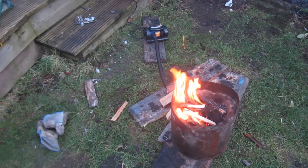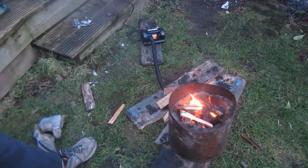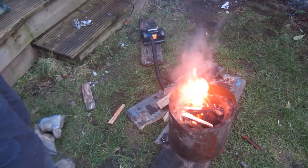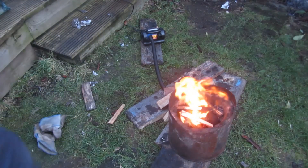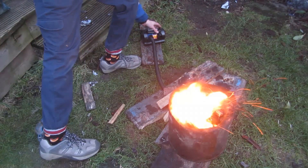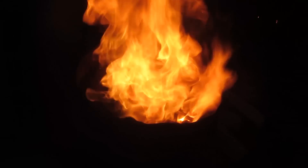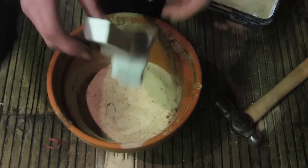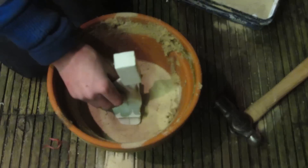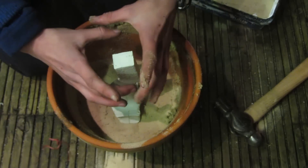Now it's time to cast the slingshot and the first thing I've got to do is turn on my forge. This is just a simple coal or charcoal powered forge. If you want to know how to make one, there's a great tutorial by Grant Thompson the King of Random on his channel — I'll put a link in the description. This forge works by putting the fuel — either coal, charcoal, or smokeless fuel — inside and then turning on the blower which supplies lots of oxygen to the fire and makes it get really hot. While the forge is heating up it's time to prepare the mould — I'm going to bury the foam inside some sand. You want to make sure the sand is quite dry and fine; the finer and drier the sand, the more accurate your casting is going to be.